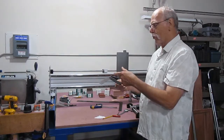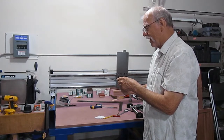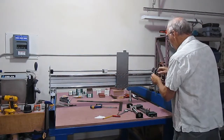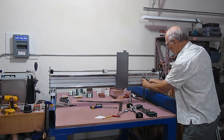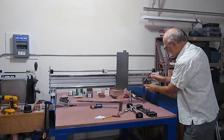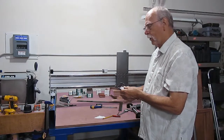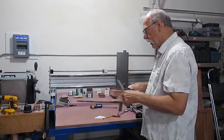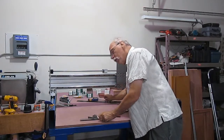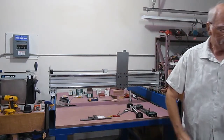And of course, this old scale you won't be able to read it, but it's 9 inches and 1/32. Come over here and do the same thing on this end. Hold it up snug, not so snug that you can't move it. Read the scale, 9 inches and 1/32. Now that's a visual measurement.